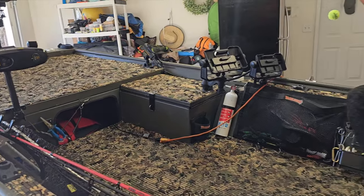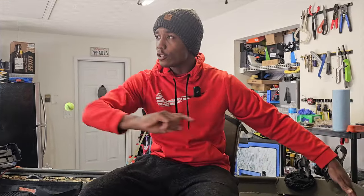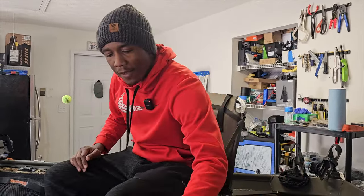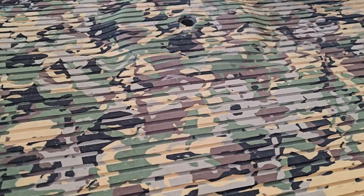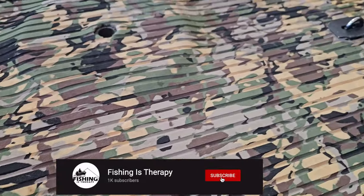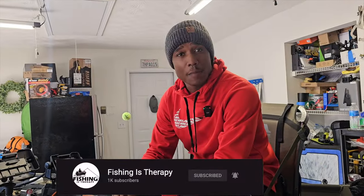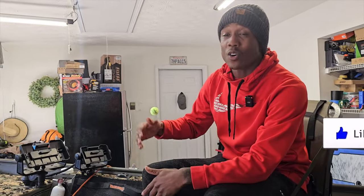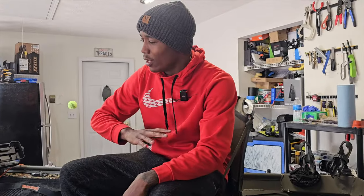This hydro turf — and I'm not saying you need hydro turf specifically, it is a more expensive option — but when I get mud on it I can just rinse it, the water beads and runs right out. I've spilled things on here, had guys on here with cigarettes, beer, anything spill. Look at this hydro turf — it's still in really good shape. I can just wash the stains off. It helps you in winter so you don't slip when your feet are wet. It helps with heat, with dropped ashes, sticky drinks, or blood from the fish you catch. Upgrade to that and it'll reduce the glare of heat bouncing off and hurting you — you don't want that wet plywood floor you can't walk around on.